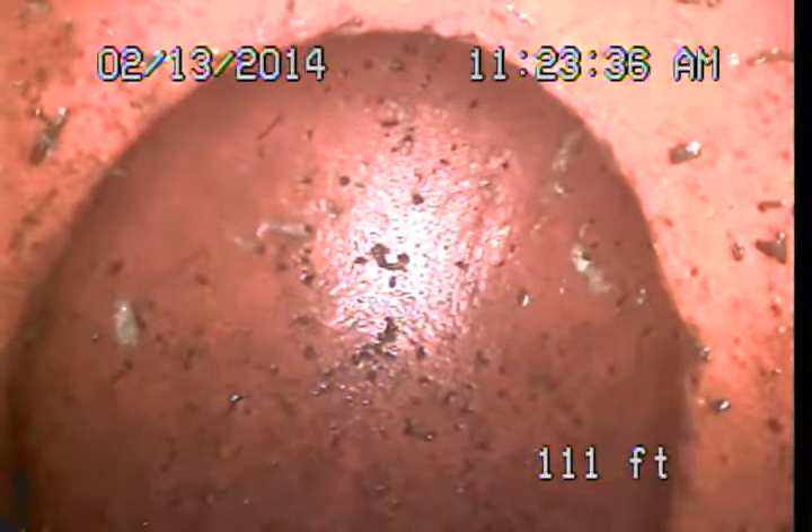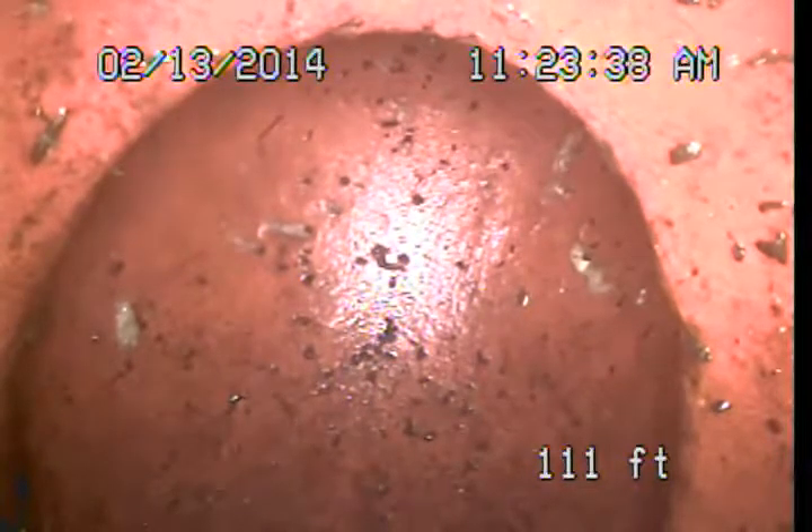The access we currently have is not really sufficient to effectively clean this section of the line — it is too far and there are too many turns. So I am going to mark out down by the lower driveway exactly where this line is. You will see what we do is we make a short vertical drop and we are coming up, and at the top we have a fitting that has an opening that probably could be exposed and extended up to the surface and utilized as a clean out.